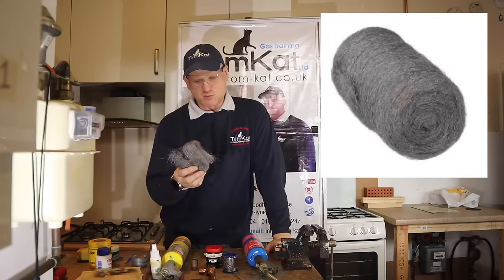I'll clean with the wire wool. Get a big chunk, put it in your hand, and spin the pipe — you won't get little bits in your fingers. We need to clean the pipe and also clean the fittings. This is a 22mm equal T. This is a 22-15-22 T with 15 on the branch. That's a 22mm male-female elbow, and that's your standard 90-degree, what we call a knuckle elbow.